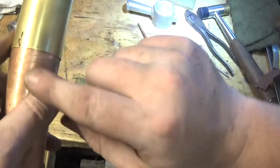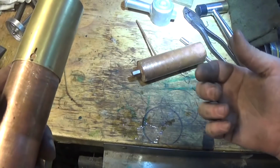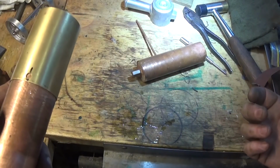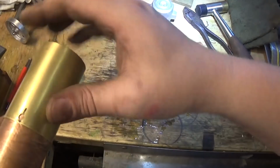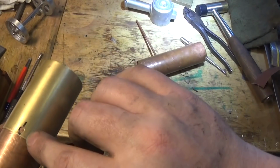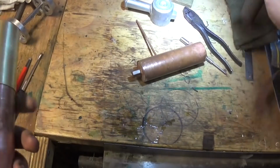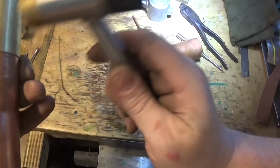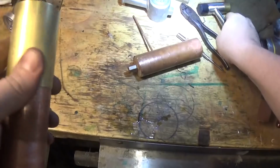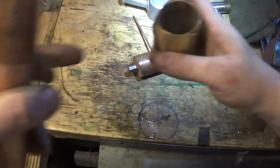And if your drill's not cutting real well, or you're not holding onto it tight enough, which you're going to need to hold onto this pretty tight, and it grabs, just put it over your scrap bit of tube again. Give it a tap with a soft hammer, and if it's a bit tight on your tube, do the same. Give it a tap. Job's fixed. Clean the burr out of the inside too, don't forget that.